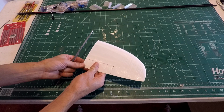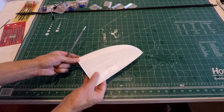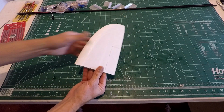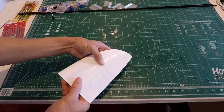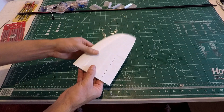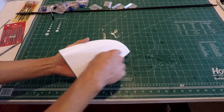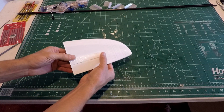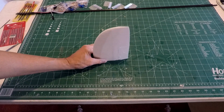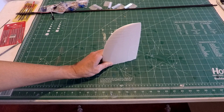If it's taking longer than that, then there might be something wrong with your print settings, and you should reevaluate them. Like this one, you can see that as the print got near the top, the part was wiggling a little bit, and it didn't quite get the best alignment at the higher edge, because it's sitting on the printer like this, and the top is wiggling around. Reason to have good bed adhesion.